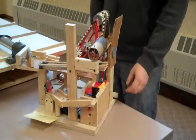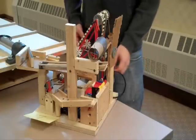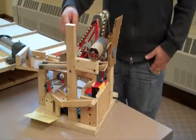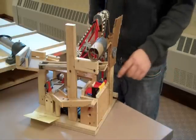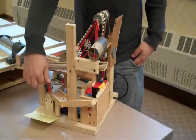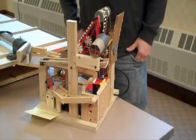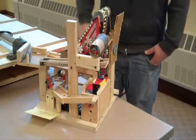Power from the input shaft goes to the belt, which turns this shaft, which has a special brass bearing. That turns these belts and this chain that lifts up the ball. It goes down the ramps, hits this spring, which pushes it down. This shaft has cam lobes on it, which move the LEGO guys up and down to propel it past there. It goes down this ramp and hits a back plate, which attaches to a gear, which turns another gear, which hits a little arm that hits the equal sign of a calculator — counting how many cycles it goes. Then it bounces back down and gets loaded up on the chain again.